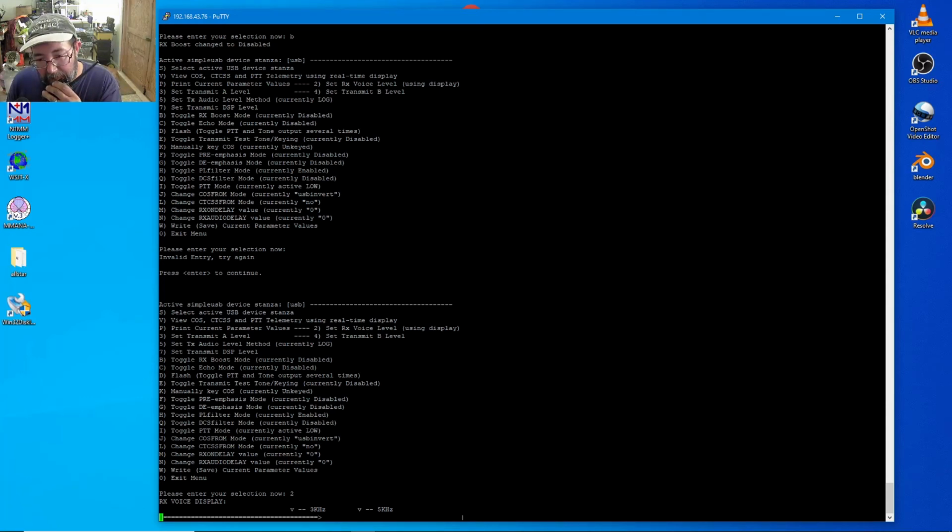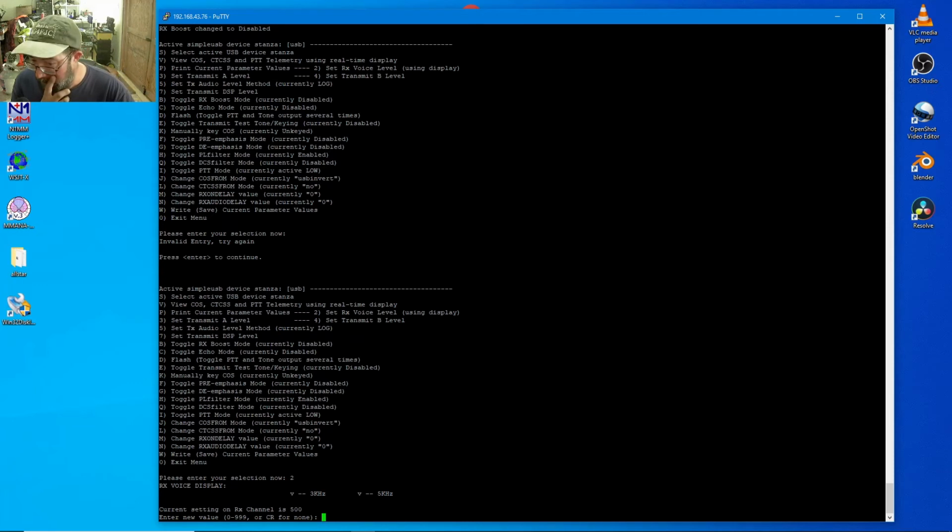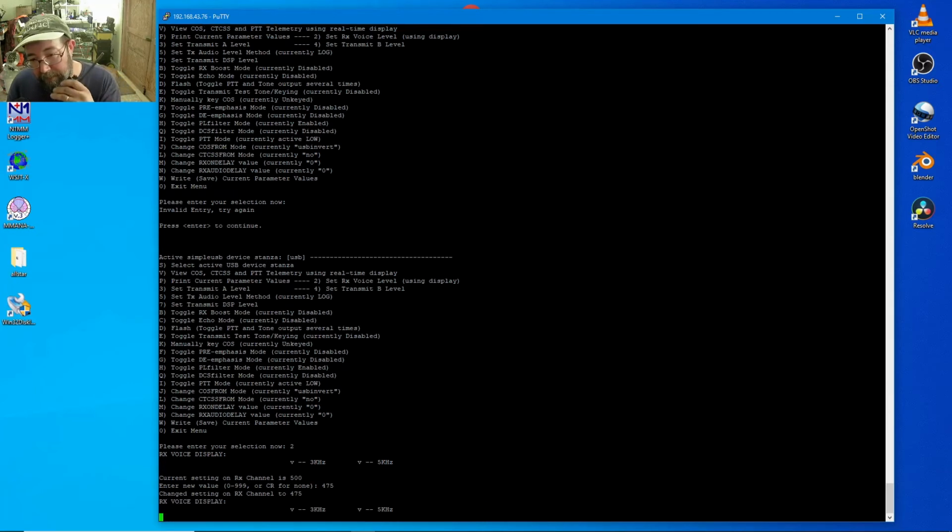Believe it or not, we're pretty close. You want it to be definitely between 3 and 5, with your peaks right around the 3. That's actually pretty acceptable, but just for giggles, let's knock it down just a little bit. Default is 500, so let's knock it down to 475. Hit enter again. Do it again. We'll go with that. That should be okay.